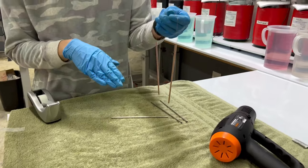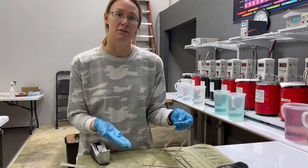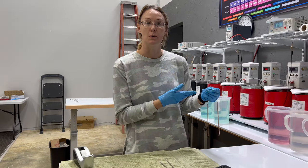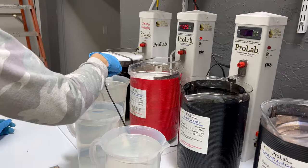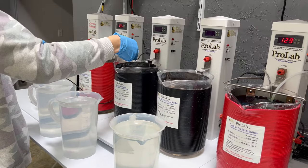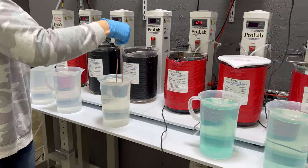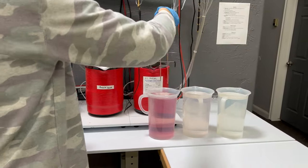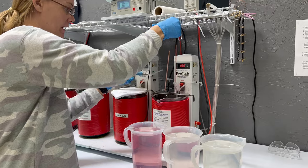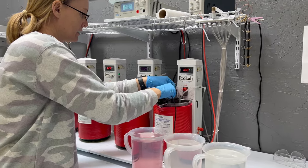Because the parts have dried out, we have to repeat the ElectroClean. Now that the surface is copper, we'll use our Surface Activator for about 10 to 12 seconds to activate it, and then it will be all ready to go into our Gold Solution. Now we are ready — I will do one more rinse before going in, just to avoid any contamination. I'm going to straddle my parts on there and connect my alligator clip.